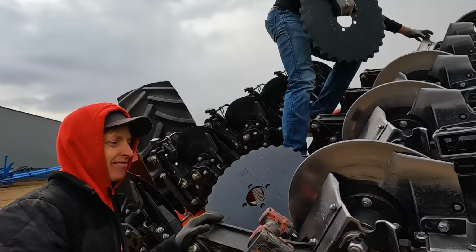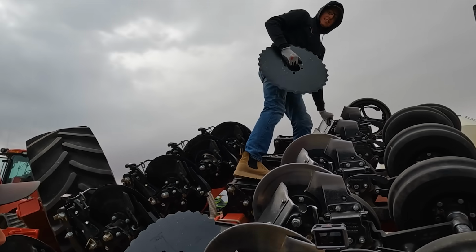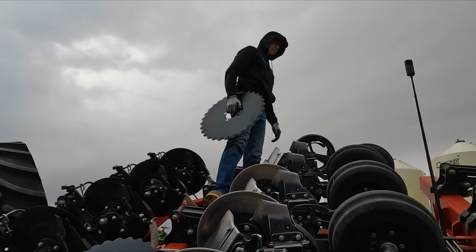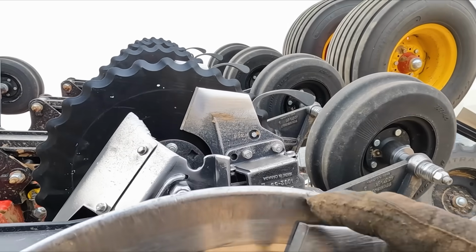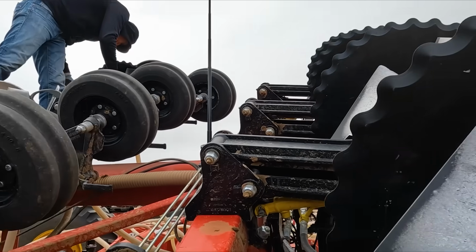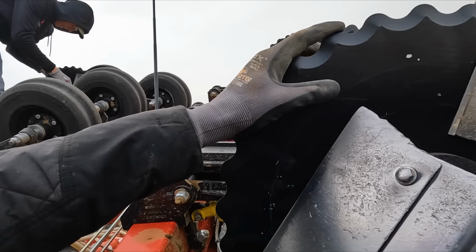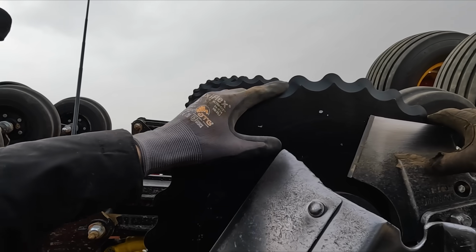There you go. I think this is the easiest way to replace discs, when it's winged up. I was looking at crawling underneath, but other than teetering a little bit, this is not bad. So we're gonna have to adjust the scrapers, and we want three-quarters of an inch to an inch adjustment there. So what do you figure on the valley? When you adjust scrapers in, you must go to the valley since that would be the closest. I would do an average cut. Your tip's going to be, let's say, half an inch on the radius bigger. So just go in between.